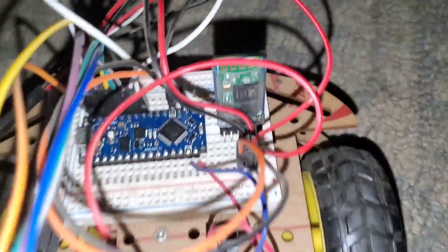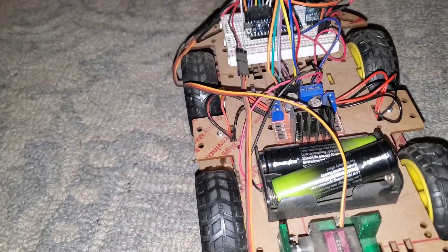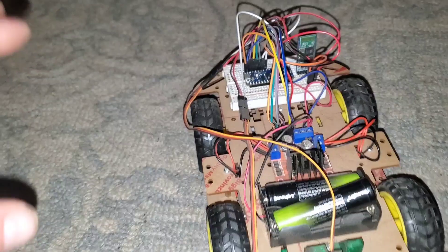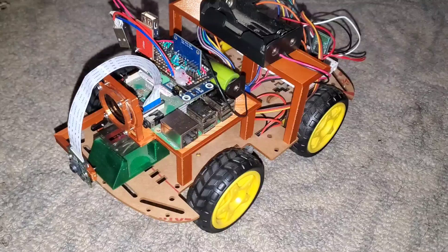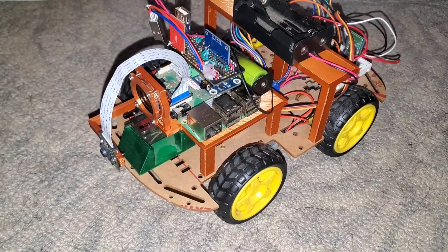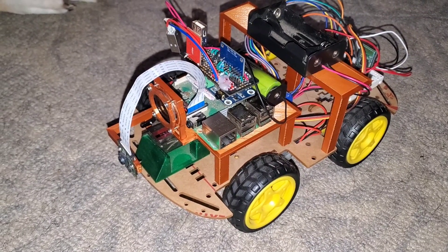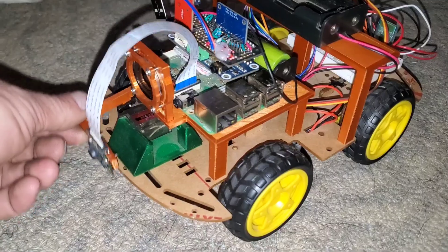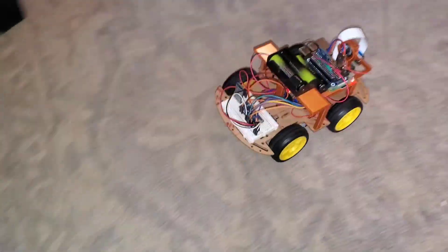Another great thing is this robot already has Bluetooth, so literally all we have to do is mount the Raspberry Pi and give it power. We don't actually have to make any physical connection to the Arduino or the motors from the Pi because we can do it all through Bluetooth. Oh my god — it worked! We have movement! Now let's get started on navigation.